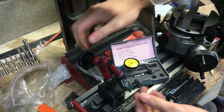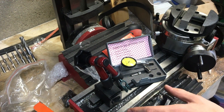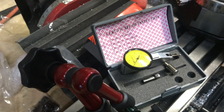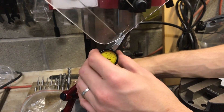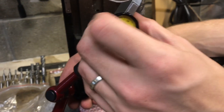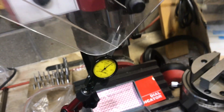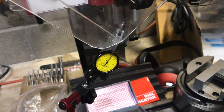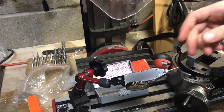Overall, I think this is a pretty nice set for a base and an indicator. I haven't had much chance to test it yet, but so far I think it is pretty good quality for $20 on eBay. With this indicator and base, you could indicate your spindle by pushing it so there's pressure on the needle, tightening it down, and then when you turn it on you can see how much the spindle is wobbling — and it's not a lot. It's true within probably about half a thousandth of an inch.